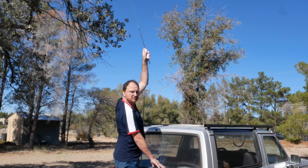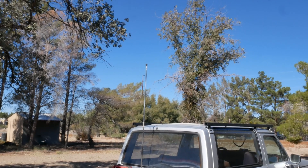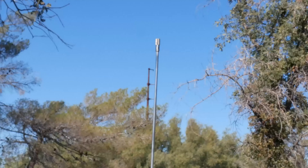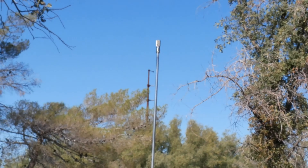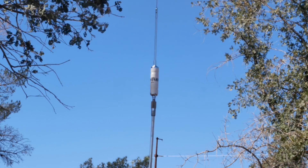As I mentioned, I checked this mast when I first purchased it — without the spring, without the Quick Connect — to see if it was resonant on 6 meters. It was nowhere close to resonant at 50 to 51 megahertz; it was resonant somewhere around 48 megahertz, which is an epic fail. Hustler, or Neutronics Corporation, has put it out there in the past that this mast will resonate on 6 meters. I'm not going to blame Neutronics because the 54-inch mast isn't resonant on 6 meters in this application. After all, there's a wide variety of mounting points and sheet metal interference from the vehicle that Neutronics could never factor in. As Dave Kassler said, first rule of antennas: everything affects everything. So using the mast on 6 meters in the conventional way is out.